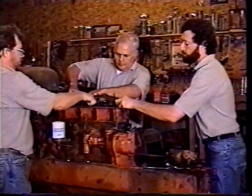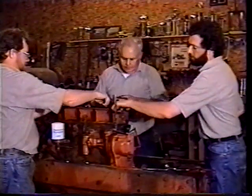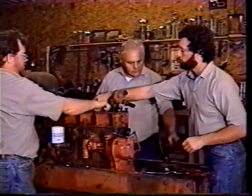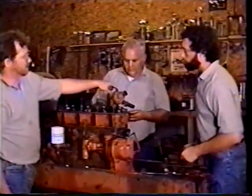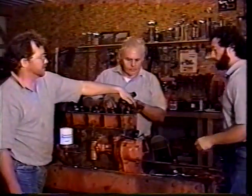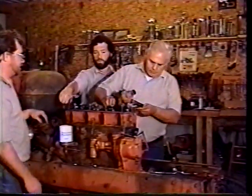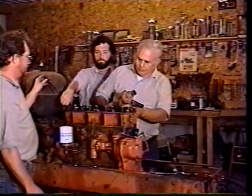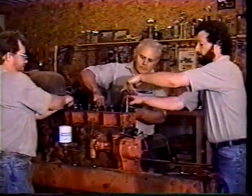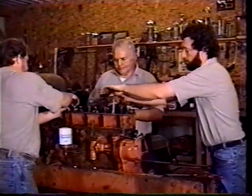The big bolts, according to the manual, we're going to torque them at 70 pounds of torque. The small ones that Herb has up here in the front, there's three of them, are torqued at 25 pounds of torque. So we're going to torque all the head bolts down. This water outlet here that goes on top, there's two nuts that hold that down. You want to make sure you have this long front bolt in first before you put that water jacket on, or else you're going to have problems getting that bolt in. So plan ahead and get that on, and then you won't have a problem later and have to take something back apart. We're going to run them all down just with a regular ratchet wrench. Then when we get them all down snug, we'll take a torque wrench and we'll go to torquing them.